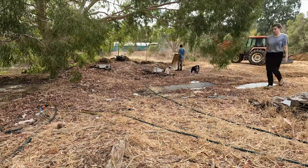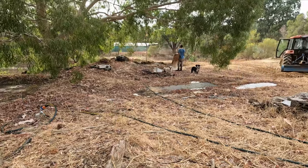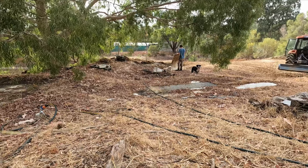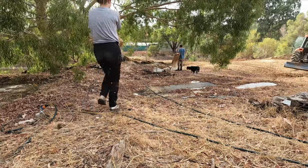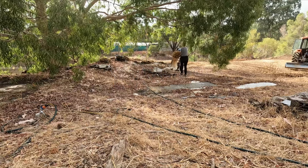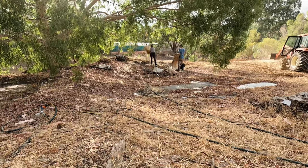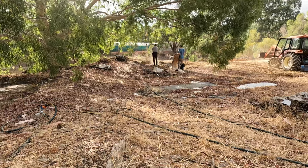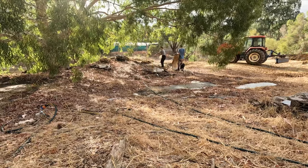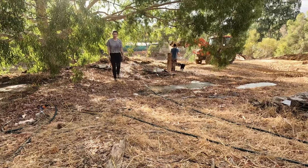The second most common question I get is: isn't the mud going to melt or soften in the rain? When you mix hard mud with water it does get soft, but the way we counteract that is — first, we build the first layer of the wall with rock, so about 400 millimeters up from the pad is a rock wall before we start building the mud wall, so any water sitting on the ground isn't going to reach the mud at all. Secondly, we cover the outside of the bricks in a layer of oil — everyone knows oil and water don't mix, so it repels the water.